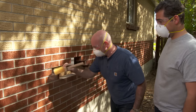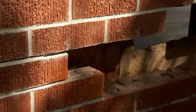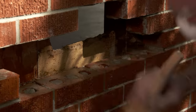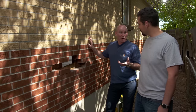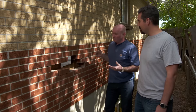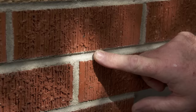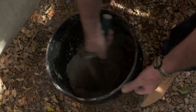All I'm going to do now is take a dry brush, get the dust off, then make a pass with a wet brush and really clean it up nice. Now we're ready to put the wall back together. We kind of lucked out — this brick is very common. We did a quick internet search, found a couple of brick yards, went over with a picture, and got it. The mortar is a standard gray; we picked that up at the home center. Now we're going to mix up and throw the brick on the wall.